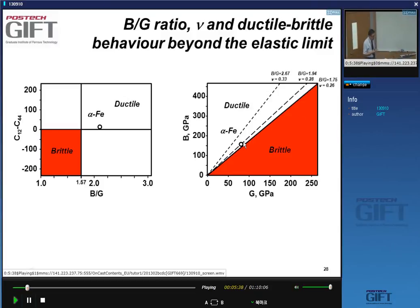We find that it's just barely above the brittle line. Yes. So obviously, and we can see from this example bending this piece of steel, that our steels are formable. Yes, they can be brittle. We'll talk about this in certain conditions, but in general, they're ductile